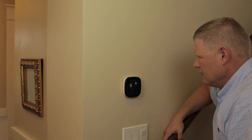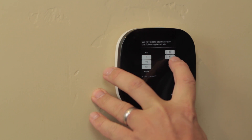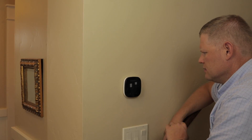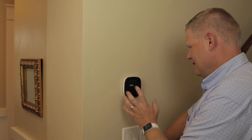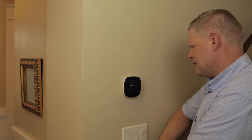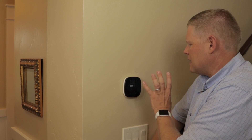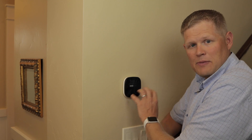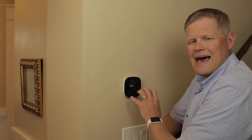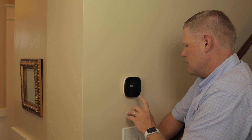Here's what it's detected for wiring: green, yellow one, white one, red, and the common blue. Smart thermostat — it knows what's connected. We're going to choose Fahrenheit since we are in the U.S. Now it's asking: do you want the fan to be controlled by the thermostat or your HVAC equipment? With these smart thermostats they can control the fan separately — it'll shut your compressor off and keep your fan running. Those coils are so cold after the compressor turns off, so the fan can continue to get some cool air off those coils. So let's let the thermostat do that.